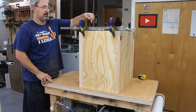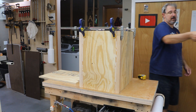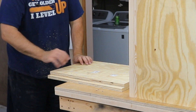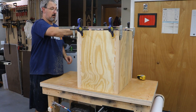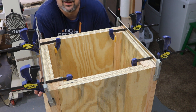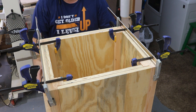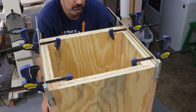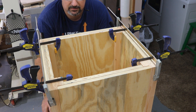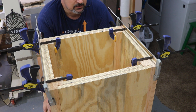I'm going to double up the layer of the plywood, so on each of these panels I will have another panel right like this. And that will create a dado on this side as well, and then I'll slip that in all at the same time and glue it together. I got all eight pieces of plywood — four for the outside and four for the center as well. It's going to create a really good glue joint and give me some extra support to screw the leveling feet in. The reason I used the 4x4s is so I can round them off to match the saw itself, so the sharp corners are going to be rounded off all the way down on all four sides.